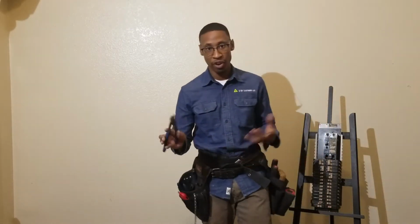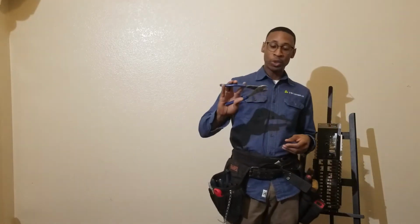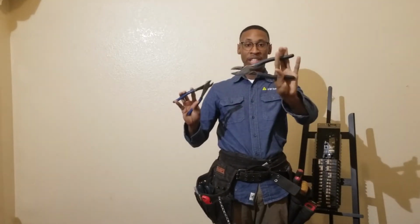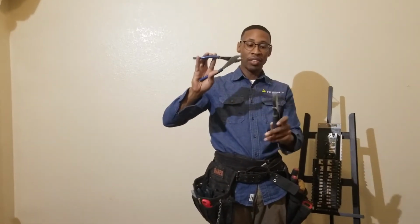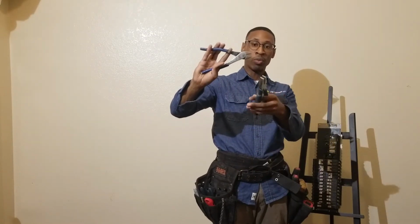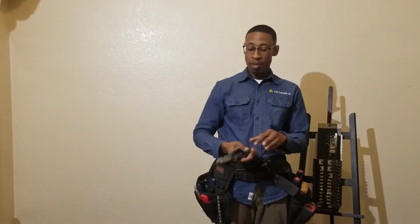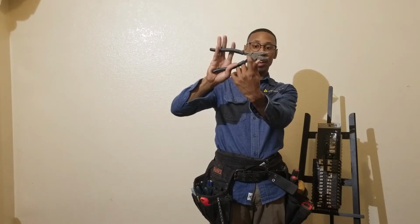So next, my primary cutting tool is going to be my dikes, or diagonal cutters is the professional term. Diagonal cutters, but in the trade we say dikes. Pass me those dikes. So this tool I use as my primary cutting tool. This tool is about $25 compared to this Journeyman series, which is about $50 to $60. I'd rather wear this cutting edge out than wear this cutting edge out, because this tool serves about 3 or 4 functions besides just one function right here, which serves just only one function, which is cutting. So I'd rather wear this out as my primary tool versus this, because like I said, I can grab and turn my wires. This is the secondary cutting tool, and I have a crimping tool right here.